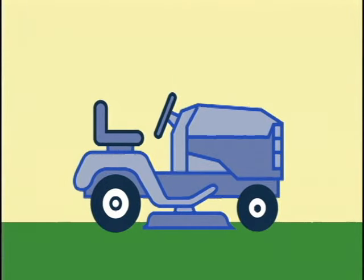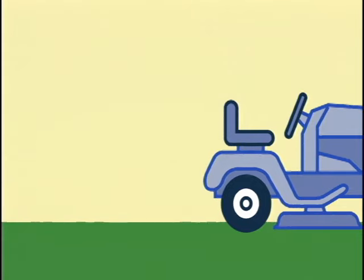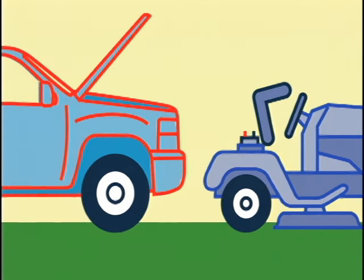If you need to use your tractor and you do not have the time to charge the battery, jumping the battery from a fully charged battery is an option. You can use the battery in your vehicle, however, the engine in the vehicle must not be running. After jump-starting the tractor, it still needs to be fully charged.